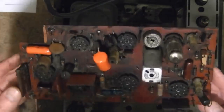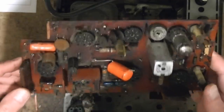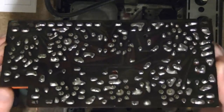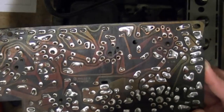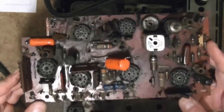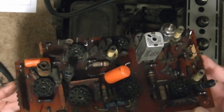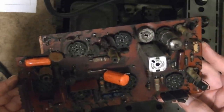Well, that wasn't too bad — pretty much the same as when I did the holiday set, though some of the wires were soldered on so I had to use a little desoldering braid before I could unwrap them. The board looks to be in decent shape — I don't see any broken foil, broken traces, or any other damage. I've printed out schematics and parts locators from SAM service info, so I'll start snipping and soldering away.